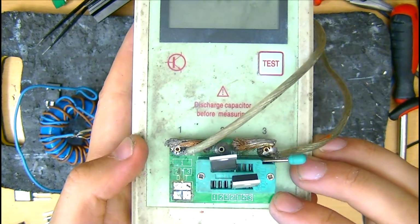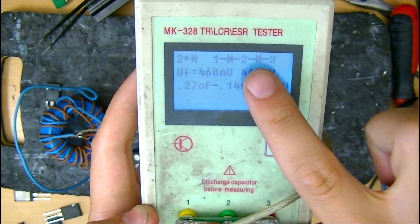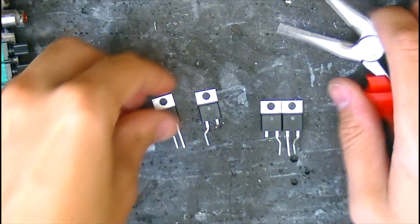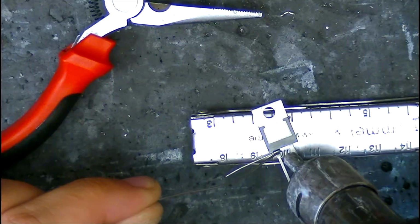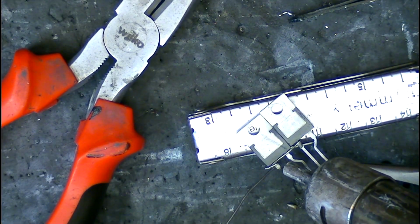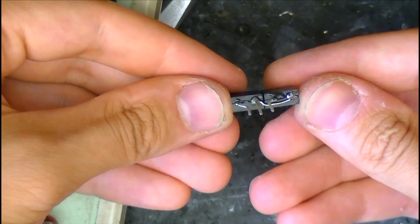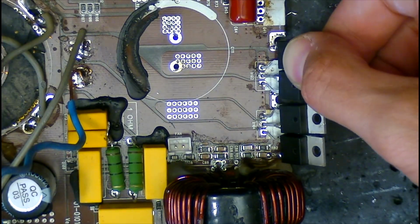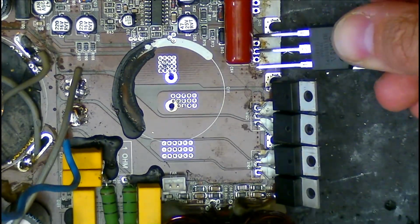You can see here in the tester, by joining the right legs together, we can create the part that we need for this circuit. Visually, it's not as clean looking, but electrically this is sound, and we have a lot more metal on the heatsink with these. A little bit more leg bending action and it's ready to be mounted into the original positions, leaving just enough space for some larger output MOSFETs alongside.